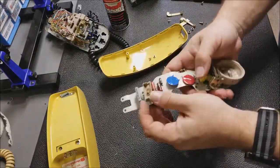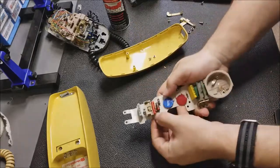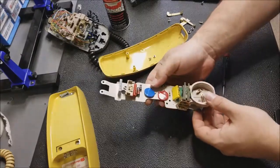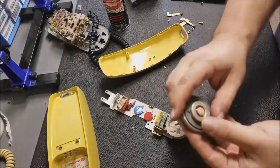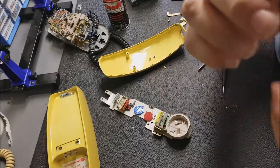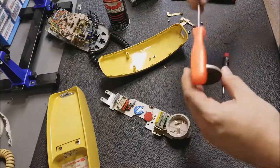Still really curious about this light though. I think I'm going to try a battery on it and see if I can get it to come on. It goes through some kind of resistor — there's a diode and a resistor. That contacts the microphone — and I don't think it's a carbon mic. Oh no, it is a carbon mic. I don't know if you can hear this, but yeah, there's carbon in here. So I'll just do this to knock all the carbon loose.